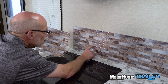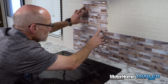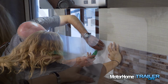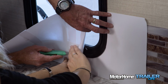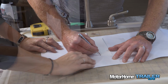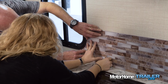If you're applying the backsplash more than 1 square high, just like brickwork, it's a good idea to stagger the edges to keep a more random look to the pattern. Likely as with ours, you're going to get to some sort of uneven edge somewhere in your project, probably a window or an electrical outlet or maybe a bathroom mirror or medicine cabinet. When we got to that obstacle, we cut a paper pattern and used that to trace an edge and cut the backsplash to shape. For outlets, remove the plate and then replace on top after applying the backsplash.